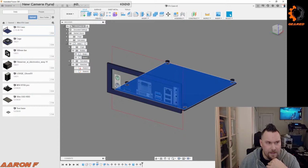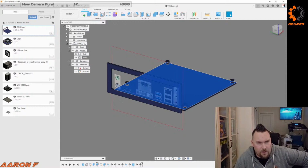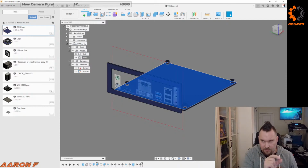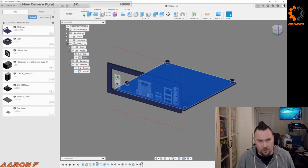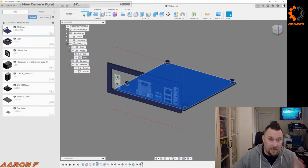Yeah, I don't know about that PanelDue splash screen thing. It seems so counterintuitive, because it requires a 24-bit bitmap, but at that size, a 24-bit bitmap is always going to be just shy of a meg. It doesn't matter how much color, or if it's a flat white or even clear. Bitmaps store all the data at every single pixel, so no matter what color or pattern is in it, at a certain bitness and size, it's always going to be just shy of a meg for what Shane needs.